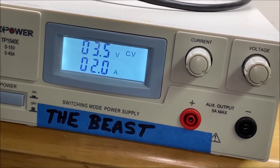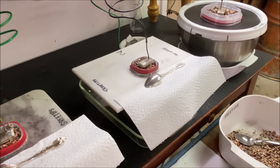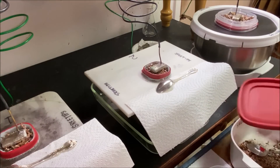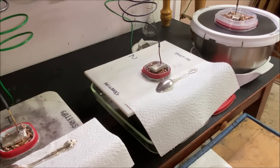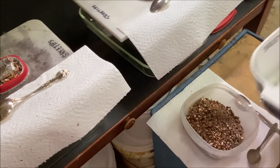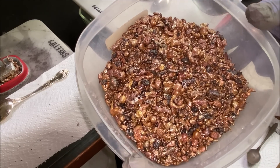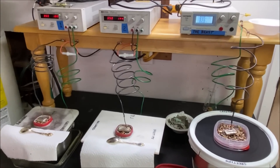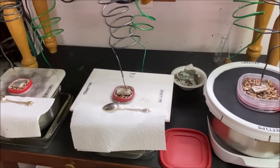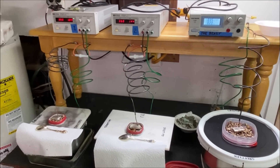The electrolyte level looks okay in this one as well. There's the current flow after we checked the beast: 2 amps. We're getting pretty close to being complete with this refining — we've only got about a couple of kilos of impure silver left in our container. We'll transfer it down into a smaller container so it's easier to handle. That's all we have left out of eight and a half kilos of impure silver that we started with. I'm very pleased with how this is progressing; the silver cells are performing beautifully. This will complete silver cell maintenance on the triple silver cell refining for day eight. Thank you for watching.